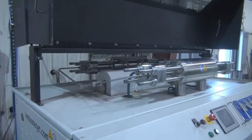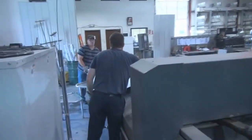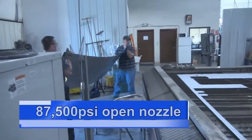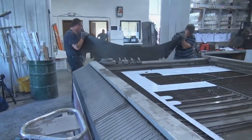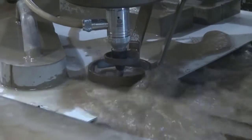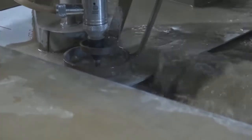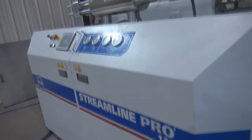With the 125 horsepower, we've got two full intensifiers — four ends stroking, alternating from one to the other. We set our machine at 87.5 and it stays there, so cut quality is maintained because it never ramps up or ramps down. It's there all the time when you need it. We've got the best of both worlds: ultra high pressure along with very high quality cuts on any thickness material. Go with the biggest KMT pump you can get and do everything on the WaterJet.